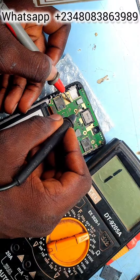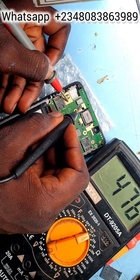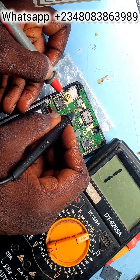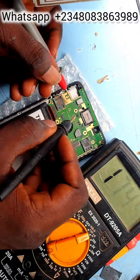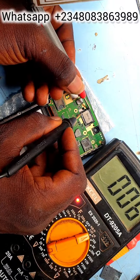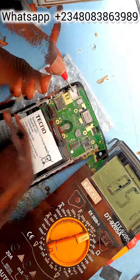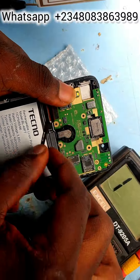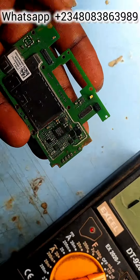Let's read our contact points. The first contact point is reading — okay guys, see. The second contact point is no reading, and the first one is reading. Can you guys see? So the issue is from the line. Reading the speaker — the speaker is also reading. So the issue is from one of the speaker lines: the down line of the speaker, the contact point is missing, it's not reading.